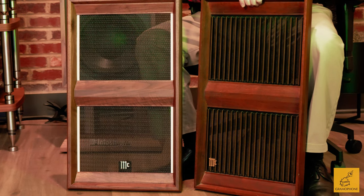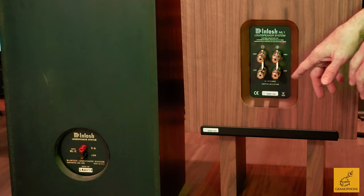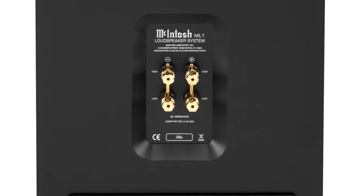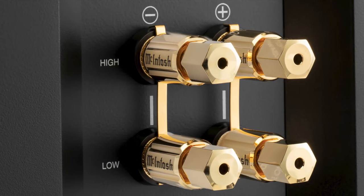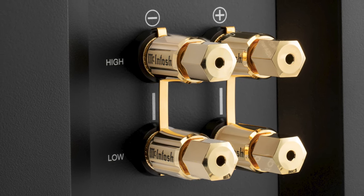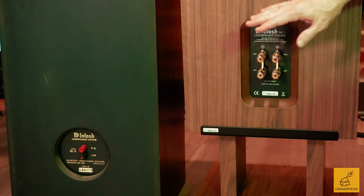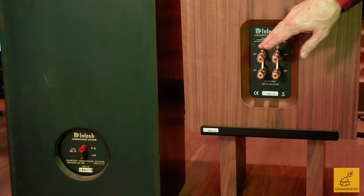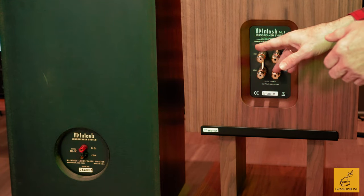They didn't think about those things necessarily in 1970 — just one more way of seeing how speaker technology has leaped forward over the last 53 years. The second thing that becomes obvious right away is the binding posts. Here you've got perhaps the most heavy-duty binding posts I've ever seen, and they're even gold-plated. There are two sets of them, so we can do bi-amping or bi-wiring, which helps make the mid-range as clean and open as possible. The original speaker has a single set of relatively pedestrian binding posts — yet another upgrade.